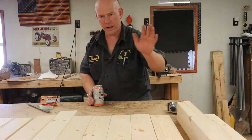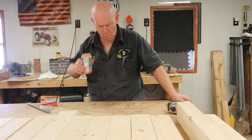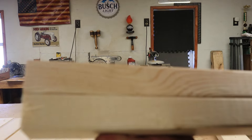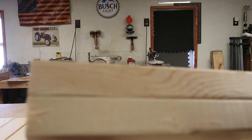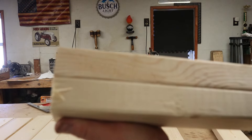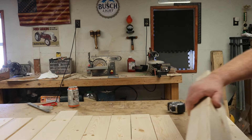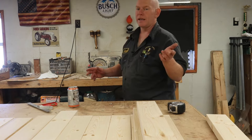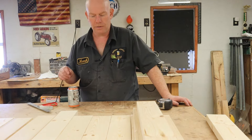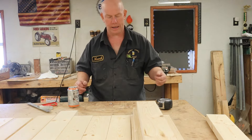I've got all 13 future stripes milled down to their necessary thickness. You can see right in there it's a nice tight line, but then right here you've got a gap — that's the snipe. The snipe extends about two and a quarter inches from the end, so my 30-inch flag is actually going to be 29 and three quarter inches. That's no big deal — a quarter inch won't hurt anything. Now I've got to go through and cut all the sniped ends off. The leading end has some too but it's pretty minimal; the trailing end is the worst.